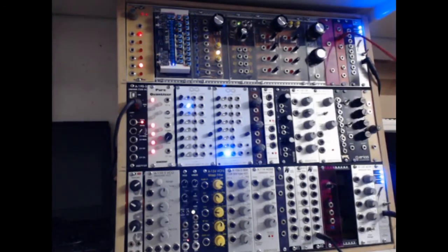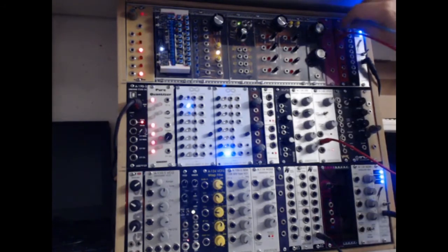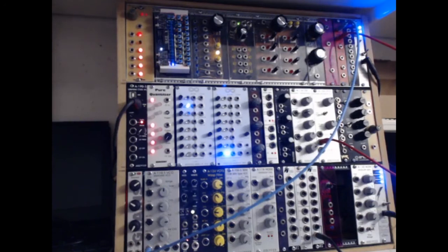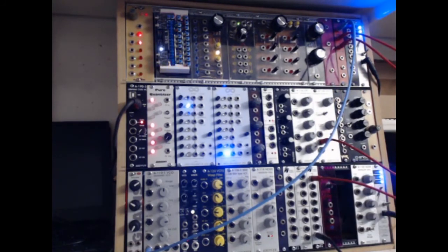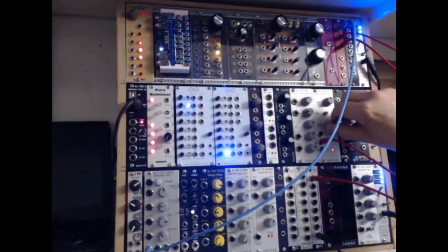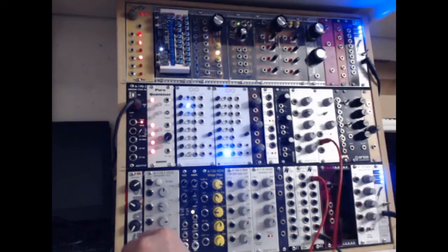This unit is another passive unit — a low pass gate using very cheap components. I'll give it a low frequency signal and patch that into the output. The low pass gate is effectively giving you a voltage controlled amplifier.